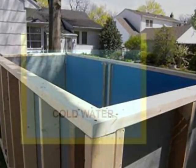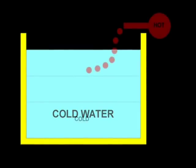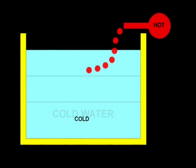They do this by taking advantage of the natural ability of water to stratify layers of heat according to their temperature differentials. The water temperature inside an undisturbed drum will eventually reach equilibrium — in other words, the temperature throughout the drum will eventually be the same. But what will happen if we add hot water? Hot water added to cold water will soon lose most of its heat to the surrounding water, and all water molecules will eventually reach a homogenous temperature. But this process is gradual, and layers of heat stratification will form first.